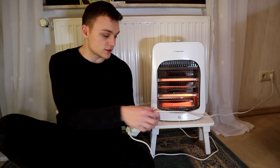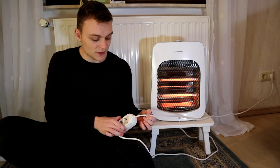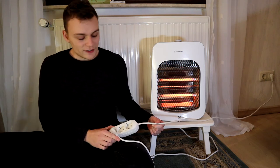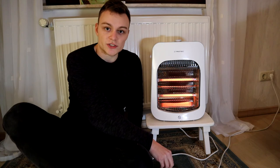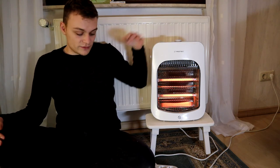This resistance at part of the cable can actually heat up the extension cord and catch flames. Especially if you use a cheap extension cord — even though the cord itself looks thick and of good quality, the inside may be only a very small strand of wire. You can do an experiment with an old cable: just grab a knife and cut it to check how thick the wire is. Often you'll see it's just a tiny strand of copper wire, and this tiny strand can't really handle power at all. So if you plug a space heater into such a cord, it heats up pretty quickly and the whole cable can catch fire.